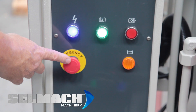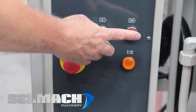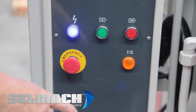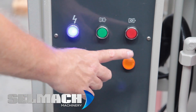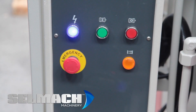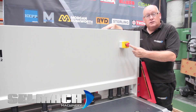Here we have an emergency stop. We have the reset button. We have the motor start and the motor stop. This will come on if someone walks in the back of the machine and will need resetting at the rear. It will also come on if you put your hand in the guard. We have an emergency stop also on the pedal and an emergency stop at the rear.